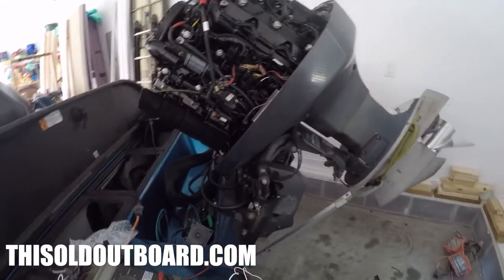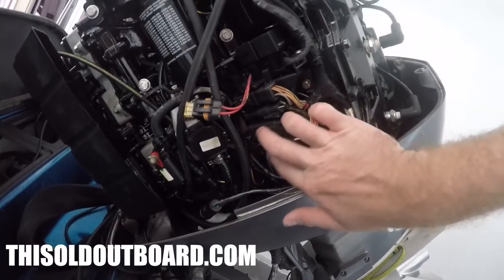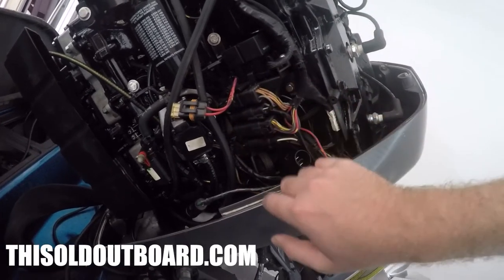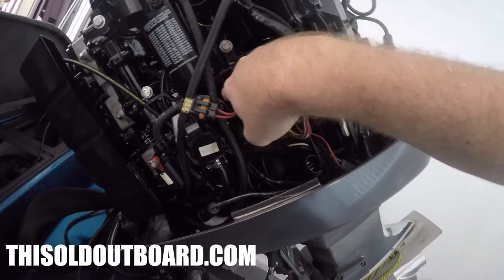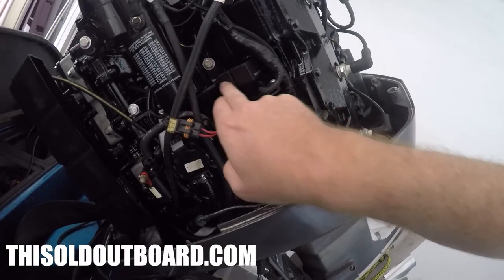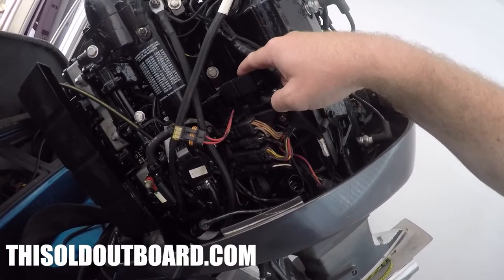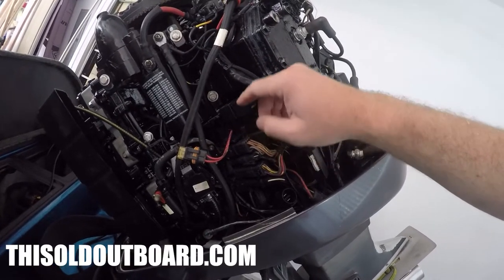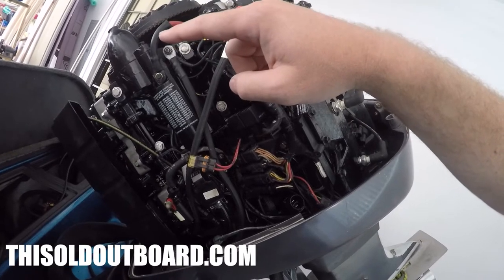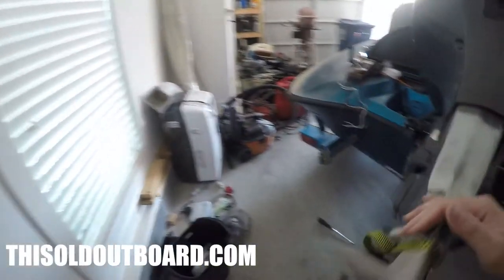What happened was the motor would not go up or down. Here are the two relays — normally there is a plastic cover plate here that you unscrew with three bolts. This is a fuse here tucked in, and there's a spare. These are the two relays for up and down. What you want to check first is if these relays are bad. A good way to tell is if you don't hear them clicking when you press the up or down trim switch. I found it best to go up to the gear shifter to do it, because the switches here make noise themselves and it's hard to hear the relays clicking.